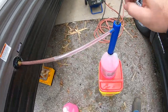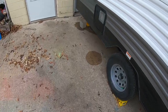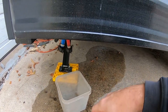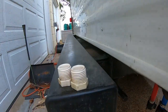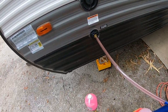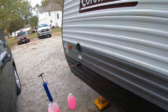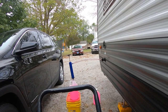The pump's going. What I didn't really consider was needing something open for it to flow better, so I'm going to start at the farthest point — the low point drains. I've got a small catch bucket. I didn't have anybody to help me — my daughter's in a Google Meet. All I did was pull the plugs off and put the bucket under there. We're going to start pumping antifreeze. This is like a hundred times easier now. When I start to hear it hitting that bucket, I'm going to stop.